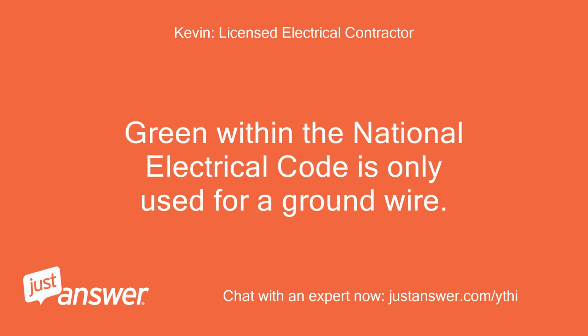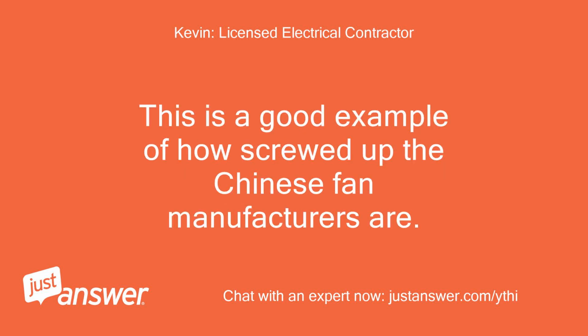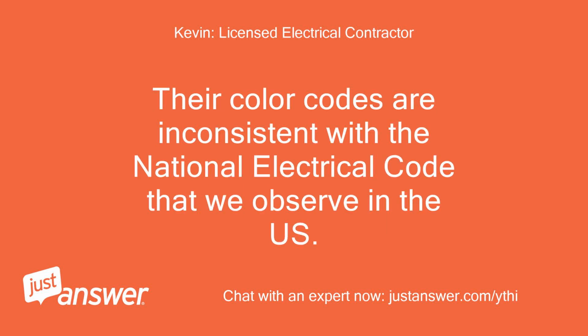Green within the National Electrical Code is only used for a ground wire. Not sure why green is part of the fan 3-speed wiring harness? This is a good example of how screwed up the Chinese fan manufacturers are. Their color codes are inconsistent with the National Electrical Code that we observe in the US.